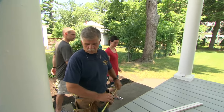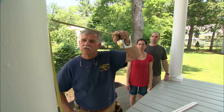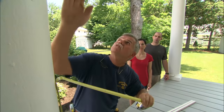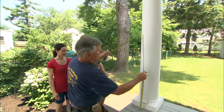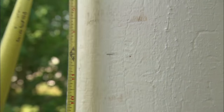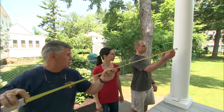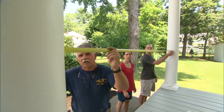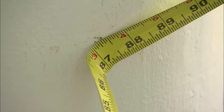The first thing I want to do is establish the height of the railing off the deck, and that's going to be 36 inches. I'm going to mark this post here at 36 inches, right in the center of it. Over here I'm going to mark 36 inches and be in the center again. Now it's very difficult to get an inside measurement accurately — if you hold that tape and measure, you have to bend the tape and it's difficult to read exactly because the tape is curved.